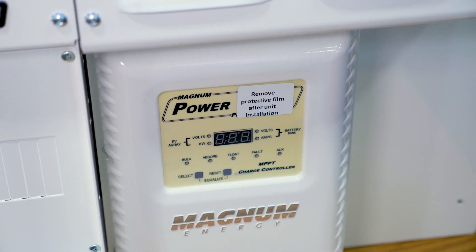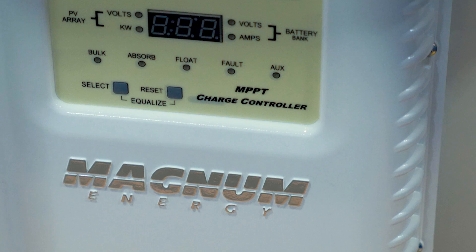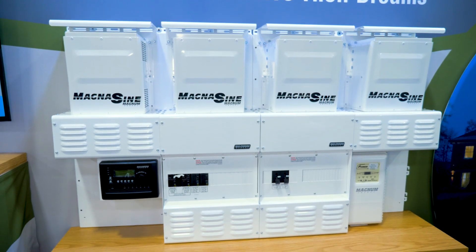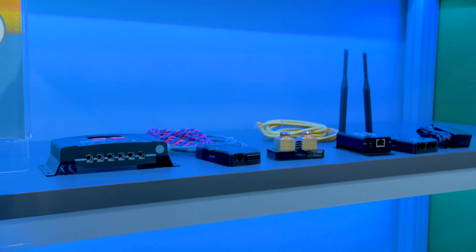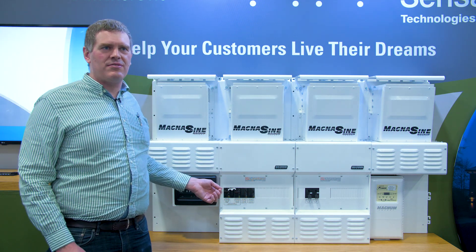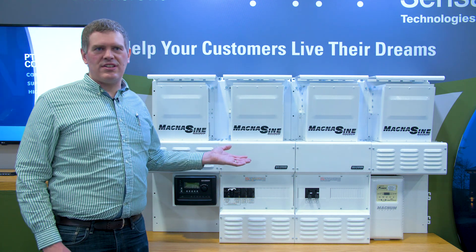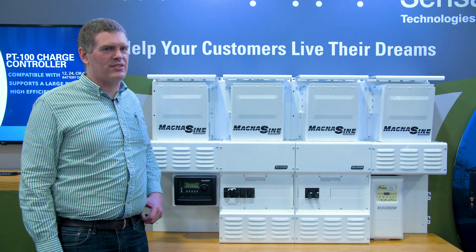The router can manage battery charging from multiple sources — grid, generator, and PV — and can prioritize PV. For example, if you have a generator controlled by our automatic gen start and several PT100s, and on a cloudy day with high power demand the batteries aren't getting charged, it can cause the generator to start. On the other hand, it can ensure the PT100 always acts as the primary source and tries to charge the batteries first.